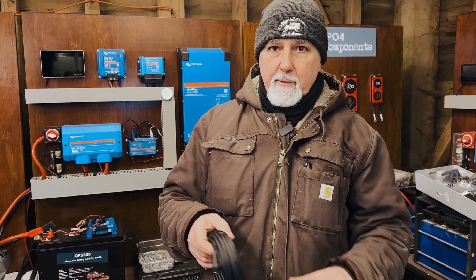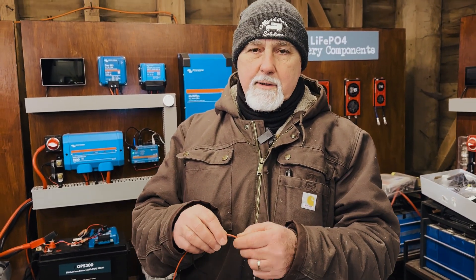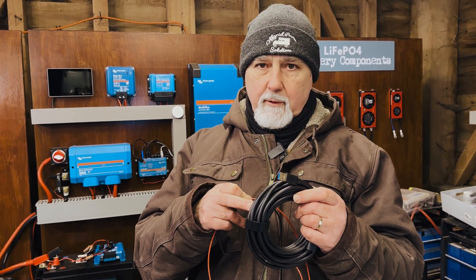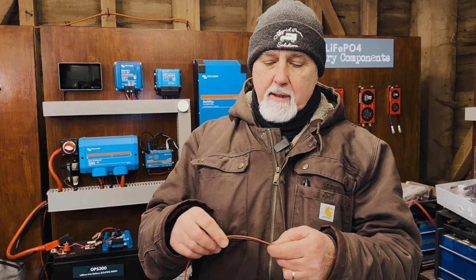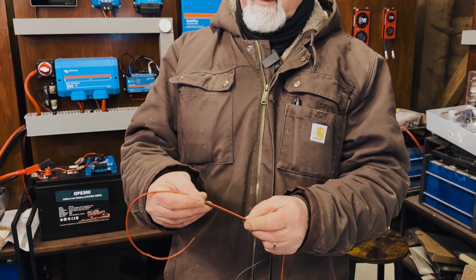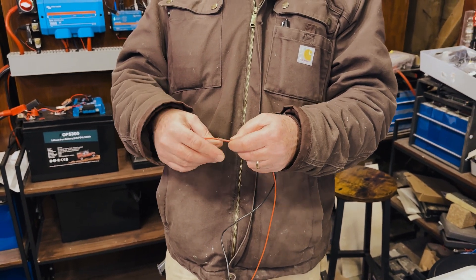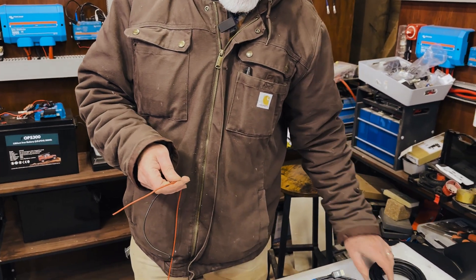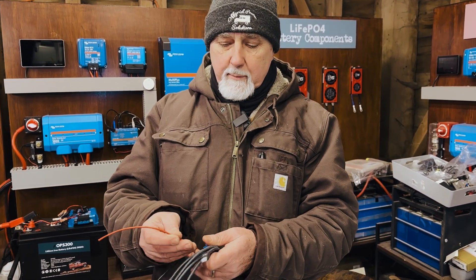So this solution does work — an HDMI extension with a USB extension — but if your distance is particularly long or you're going through really tight spaces, there's actually a better solution. Basically, you're going to be running 12 volts instead. The USB extension runs 5 volts and you get voltage drop over distance, whereas with 12 volts you get less drop and it's far friendlier to the devices. This is 2.5mm cable — very slim, no plugs to pull through — so getting it into tight spaces is really easy. We'd tape the black to the red alongside the HDMI extender and pull the whole bundle through.